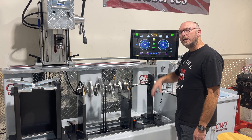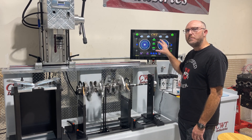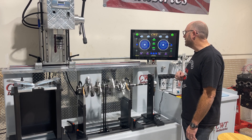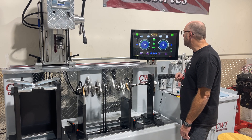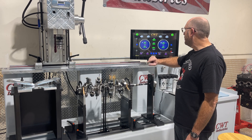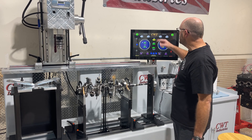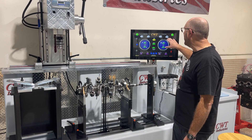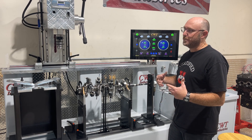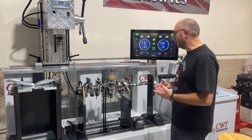Now it'll take a minute to get up to speed — it's nice and quiet while it's running. It'll get up to speed and then it's going to give me the amount of imbalance. It says analyzing, and it should be just about done. There we go. Now it shows up: my left side is 0.115, which is under my 0.118 tolerance, but my right side over here is 0.647 — or about 6.675 grams out of balance. Now to be honest, that's pretty darn good for most applications, but not quite good enough for this application.